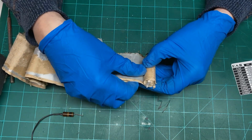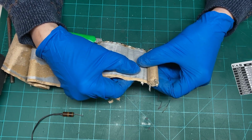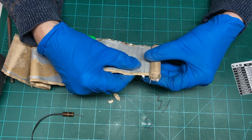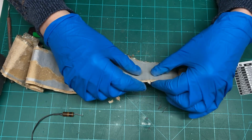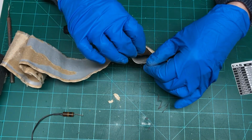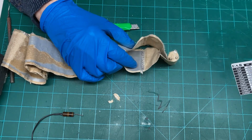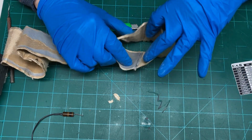Some people think the world runs on computer chips, and I'm under the impression that it doesn't. It runs on capacitors. And they are a high failure point. Okay, and here's the lug to one of the, I would say since it's the first lug, it's probably the, what was that, 80 microfarad section right here.